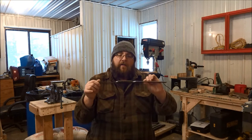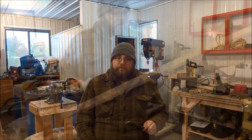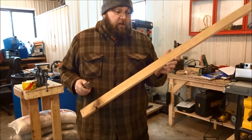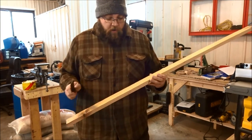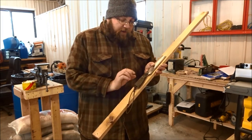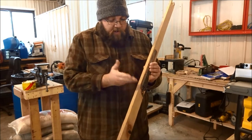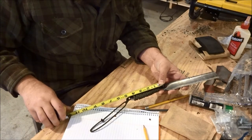Anyway, I've got this parachute cord handle on here, and I've never been very happy with it. Today, we're gonna see if we can't make something a little better. I've got a fairly clean piece of scrap lumber here. I think it's probably oak, that is a good size to make our handle slabs once we cut it down to size. Well, it looks like 4.5 inches is probably just about right.